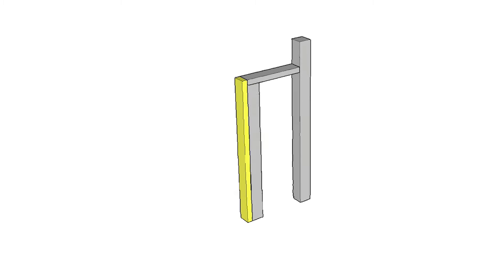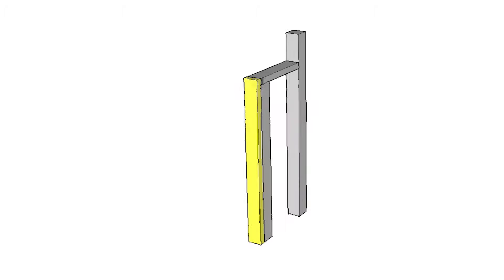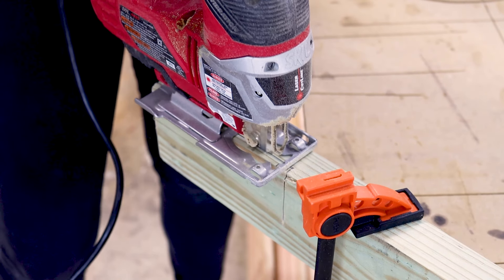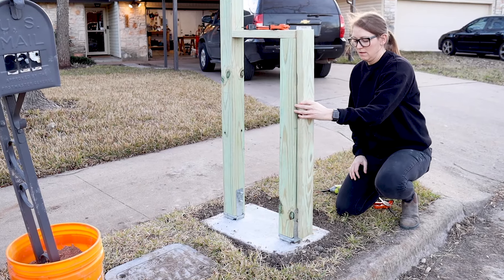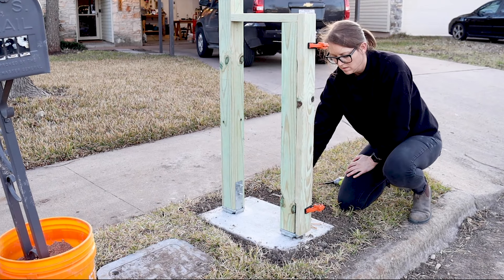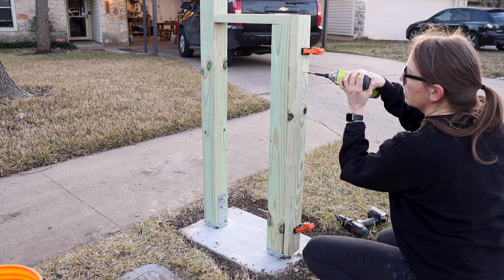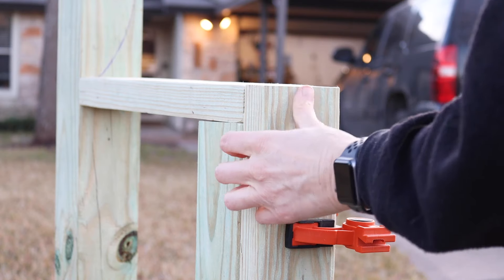The last baseboard to add is this front 2x4, which will give me a little more meat to the base. I used my jigsaw and cut out a notch where the bottom of the board will butt up next to the post anchor and the bolt heads. Then I clamped it into place, pre-drilled with a countersink bit and secured it with screws. The countersink bit will allow the screws to sit below the surface and not interfere with the slats.